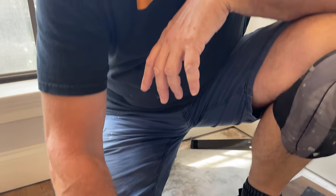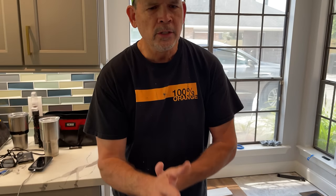So screwing a block to the subfloor is our preferred method, and if you got a wood subfloor, plywood, it's a no-brainer. You gotta try it, guys. Remember that we put our first 5 planks down and established a perfectly straight course with our laser, locked it down with our blocks. We went this direction towards the street, not one opening, not one joint came apart. Took the blocks out, finished the floor, came out fantastic. We are moving, we are grooving, we are ready to finish this floor. Let's get our knee pads on and knock it out. Let's do it.